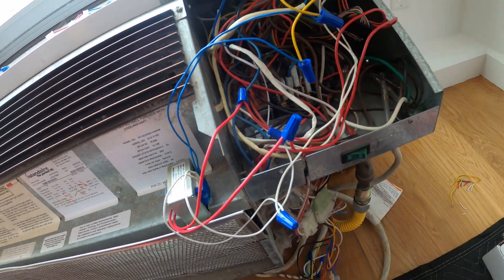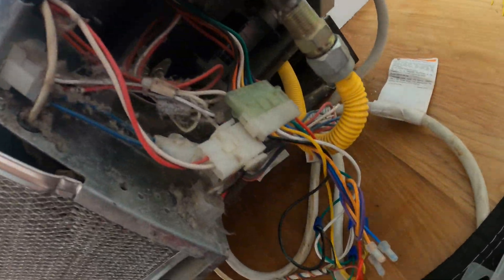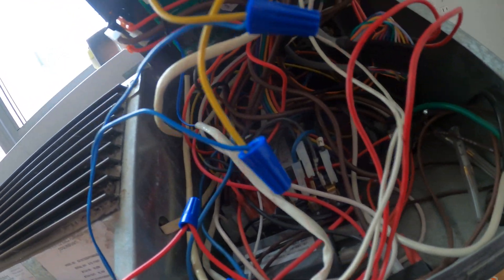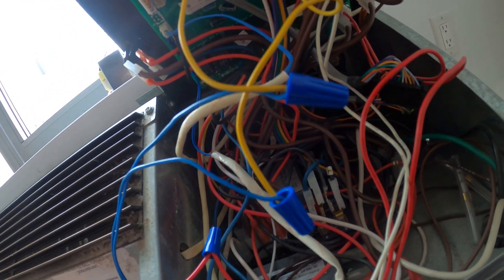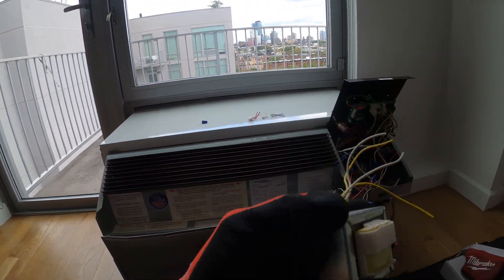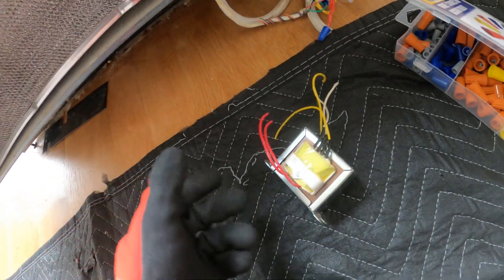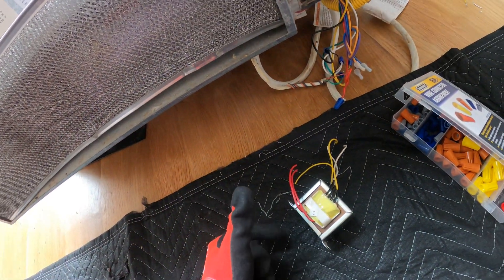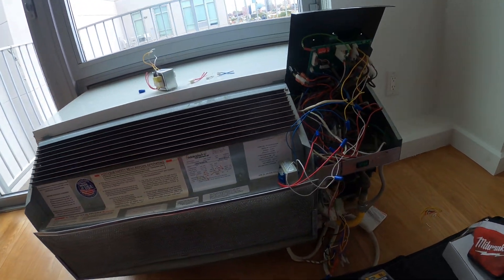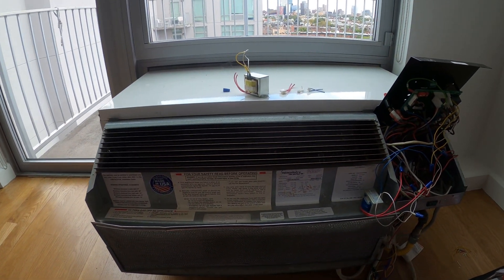We had a bad transformer. The million dollar question is why did it go bad? We've got to make sure there's no exposed metal showing on any of these low voltage connections, and same for the inside here — make sure nothing's touching metal where it could possibly short out. One thing I did see was that somebody was messing with this transformer; it was kind of just laying on its side inside. The screw wasn't even fully in there. You never know what people did, but regardless, we got this unit going now and cooling.